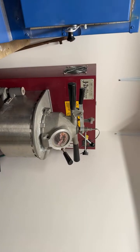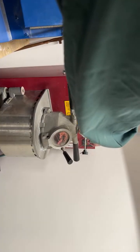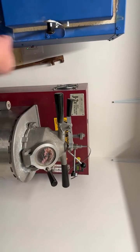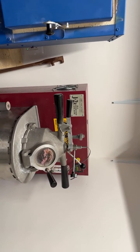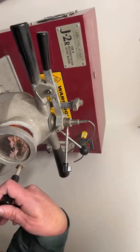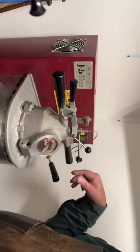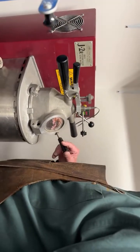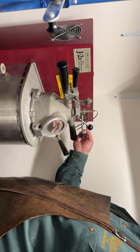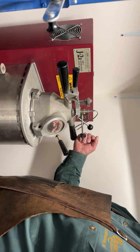Once the gold is melted, which will be in about a minute or two, the temperature is going to go down. As you can see, it's going down because of the gold. Once it turns and starts going back up again, that's when we know it's starting to melt. And we will go ahead and check it. Let me scoot on that side here. So now the temperature just went on. And this mixes the gold a little bit. Coming back up. Somewhere around 1750 is where we want it to be. But we're going to go up even a little bit more than that.